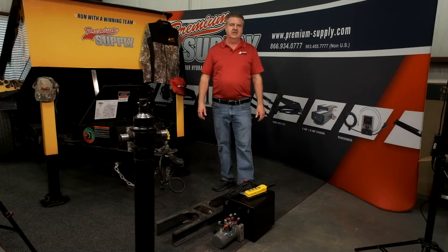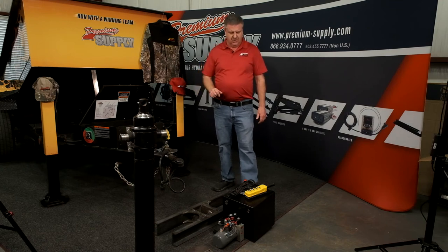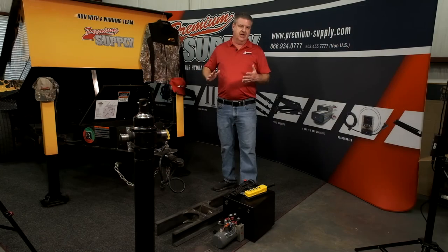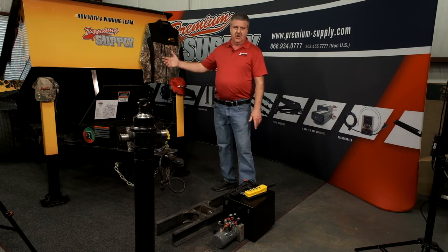The telescopic cylinder is a choice that is now becoming more and more popular. It really does give out a lot of force — that is the pro of this approach. One of the cons is you do have to have a much larger reservoir. They're only available in single acting. And if you do want to haul equipment, the trailer might come up as you're trying to load because there's only one check on the hydraulic circuit — it's to keep the bed from coming down when in the up position; it is not to keep the bed from going up when in the down position. But these things will lift a lot, which is the advantage of the telescopics. And it is all in the front of the trailer, so if you have a problem you can work on it easily without having to get underneath the trailer.